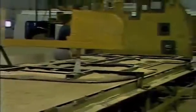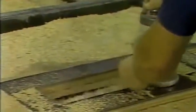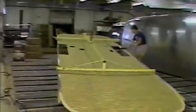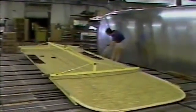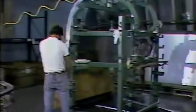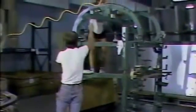While the underbelly is being completed, this one-piece, 5/8-inch thick wafer board floor panel is swung out and lowered onto the work area so this flooring jig can be placed over the one-piece floor. This jig is used to cut precision openings in the floor panel at exactly the right places and correct size every time. Upon completion, the one-piece floor panel is lifted up and lowered onto the assembly floor.